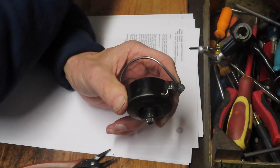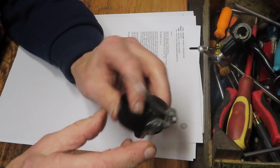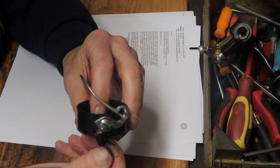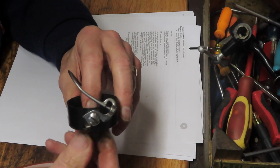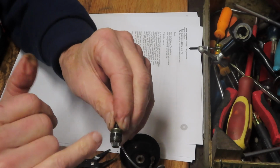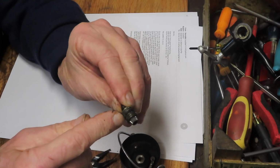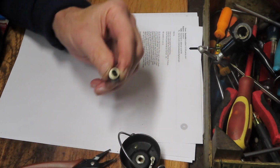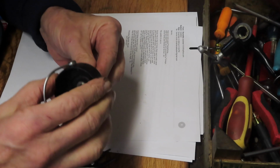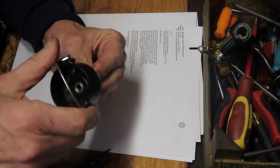Okay, you want to do it that way, and you want to do it where you roll off the bowl if that's what you need to do. What you don't want to do on this is remove the nut. There's a nut here in the collar, and you remove that. These are free spooling bearings inside here. And if you pull that bearing out, just be prepared to get on your hands and knees and search all around for them, because it's not a sealed bearing at all.